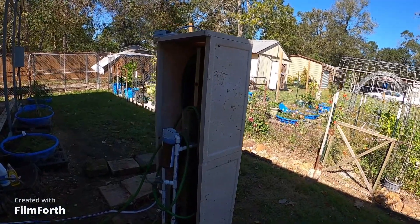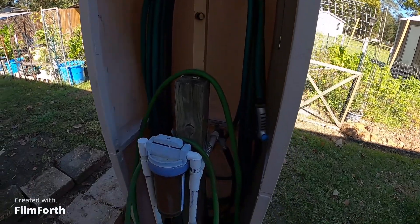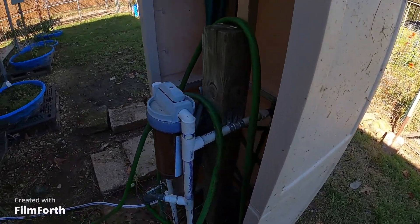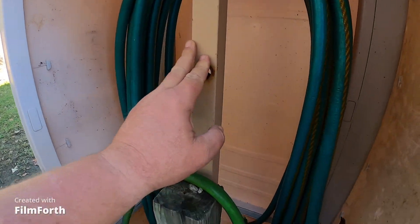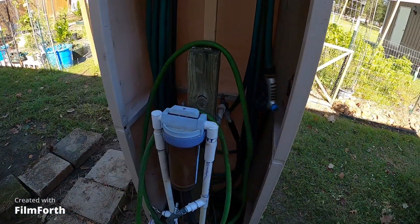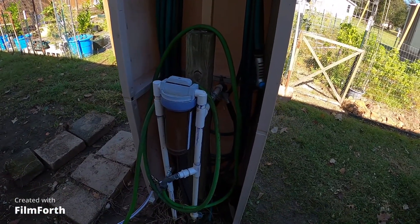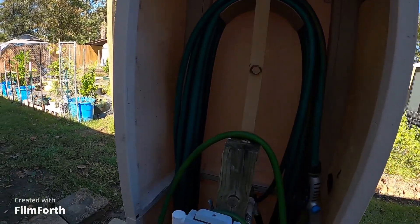So to give you an idea — that's what I'm talking about. I cut the bottom out of the box and put the box over all the water lines. Now this will dramatically block the north winds, but I was hoping the box was deep enough that I would be able to enclose everything inside of it, and it is not. Even if I took the water hose reel off, the spigot is already touching right about there. But I've blocked off the north wind and I can at least put some blankets in there, wrap the outside with a tarp and some gorilla tape or duct tape, and put my heat lamp up at the top facing down so it should heat up in there nicely.